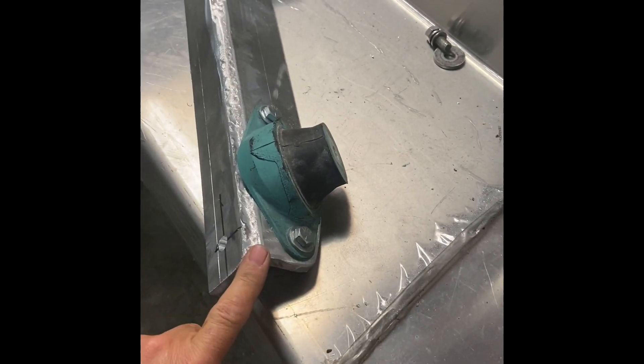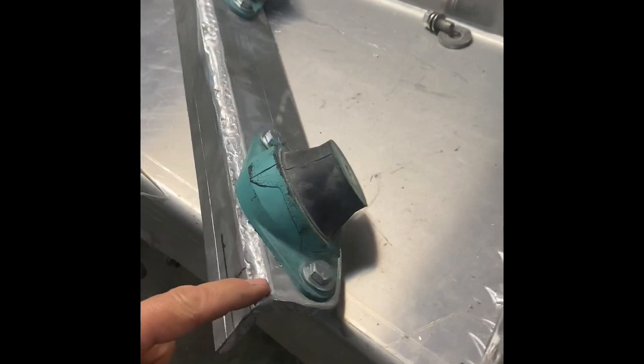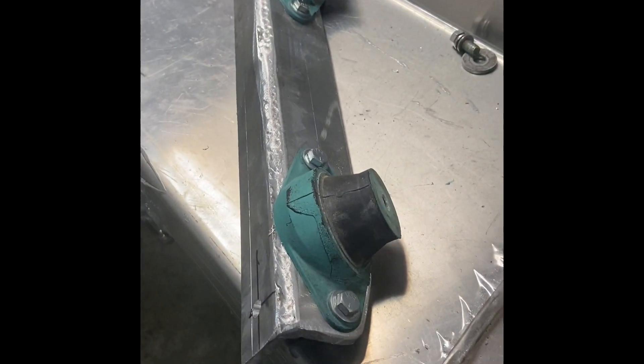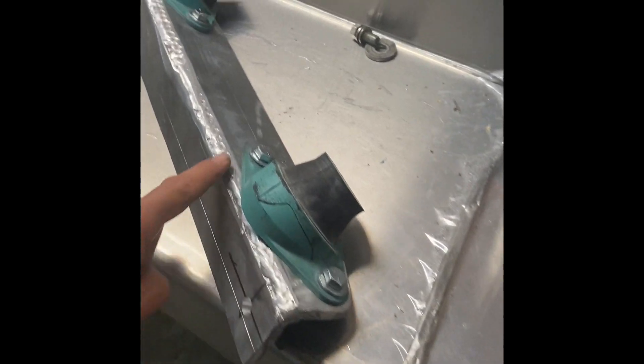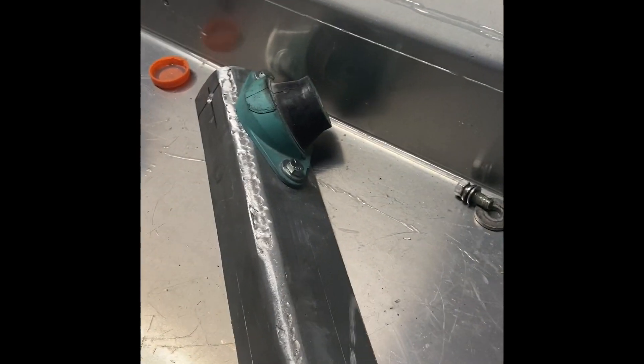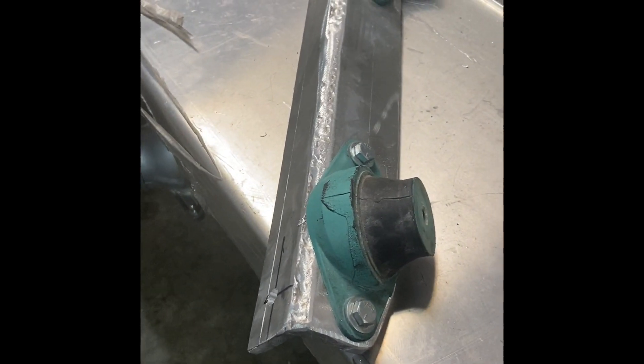It sets — I don't even care what that angle is, whether it's 95 degrees or whatever. Get it perfect and then the tack will hold that. The welding tip is: I put one weld down the outside corner edge, flipped it over, and then the inside weld pulls that back to the same angle. Then I put a cover weld — this is a big gap for my little welder. I literally couldn't get enough wire feed speed to completely fill it. I'm not too worried about the aesthetic; there are two welds in there and that's plenty strong.